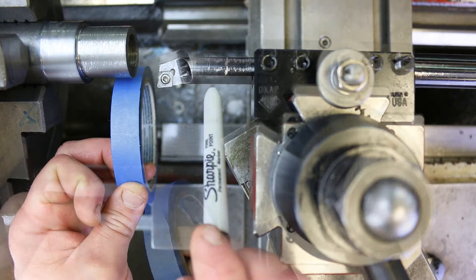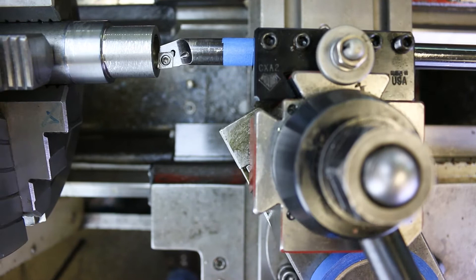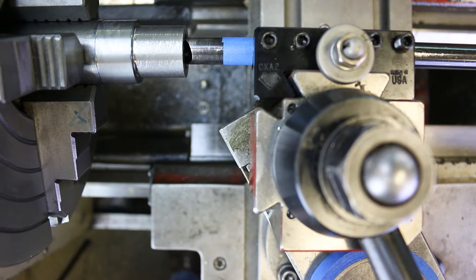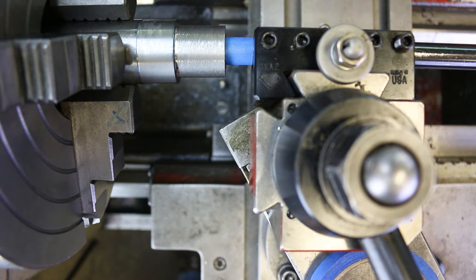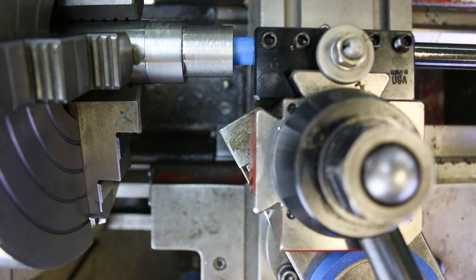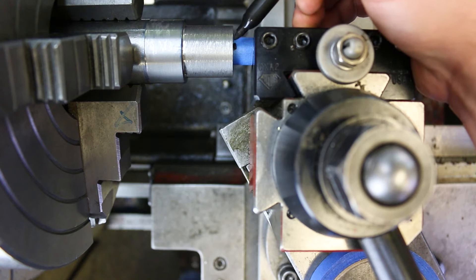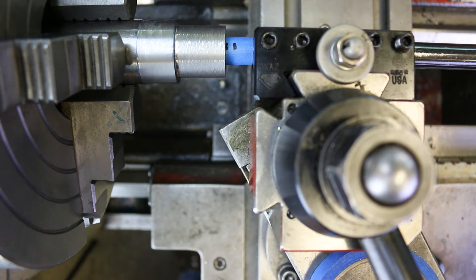I'm going to apply some tape to the outside of the boring bar, then position it up next to the inside diameter — not actually touching, but close. Then I'll run the boring bar into the part very carefully, nice and slow. These cutting edges are incredibly fragile — if you jam them into the back of the part too hard, they'll snap right off. So I'm feeling for any resistance, and right there I'll come in with the sharpie and make a little mark. Now I know where the sharpie mark lines up with the end of the part — that's where the bottom of my hole is. I'll back off a little and make another mark as a warning mark and a final position mark.